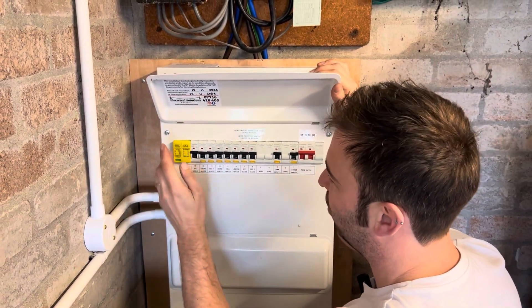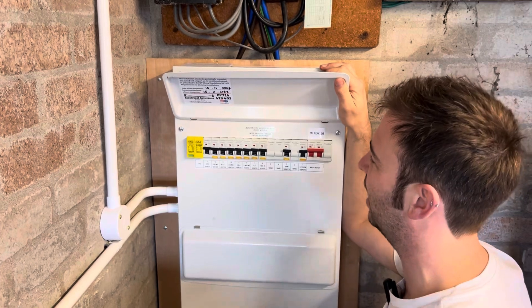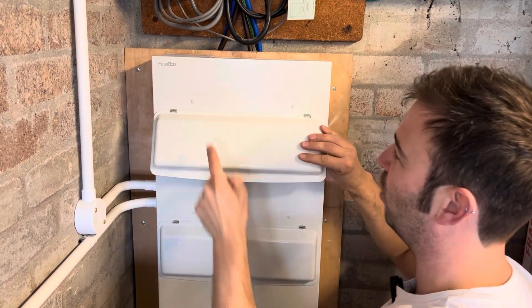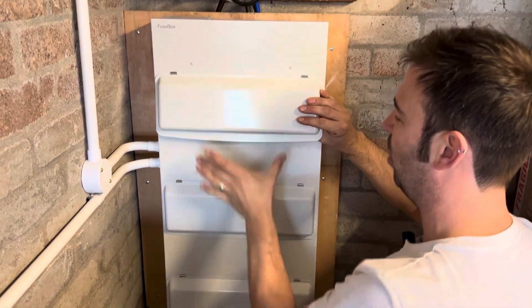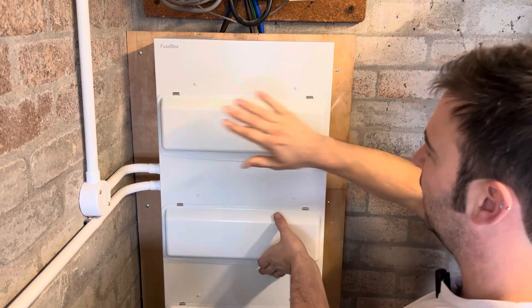The rest of these are all on-peak heaters. We've got a Type 1, 2 and 3 surge protective device — it's an overhead supply serving this installation. I've labeled it with my caution fire suppression device label. I've got three fire suppression devices located above each row of RCBOs. I've labeled the water protective bonding and where it is.